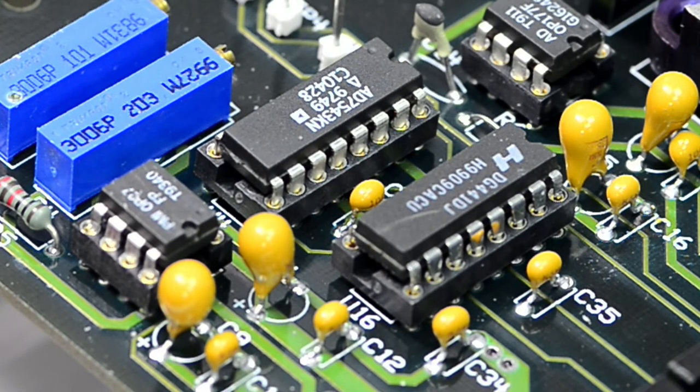So you can have the resistors tested at different currents by using this programmable functionality. And the 7543 is a 12-bit multiplying current output DAC. It's only 12 bits, so not much. Low gain drift, 2 ppm per degree, and small size, 5 volt supply. Nothing super special about it. It still costs around, let's see, $38 in 100 piece quantities on the Analog Devices website.